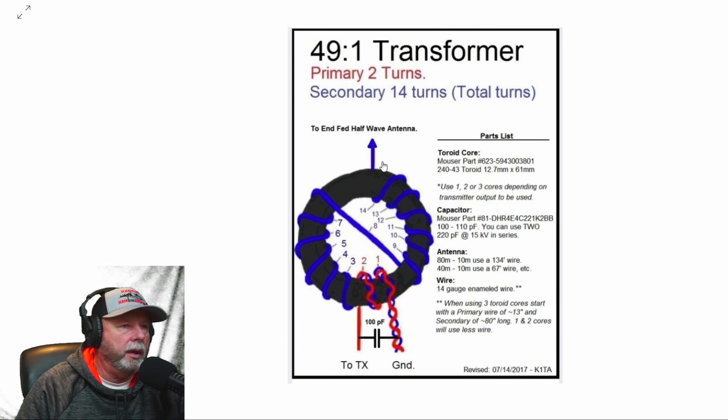The end here goes to the antenna. What I'll do on mine is put a plastic wire tie across here to hold this where it is, and then this will end up getting bent under. Somewhere in the middle I'll attach the antenna wire to itself, but also put a knot in the wire. So when it goes through the binding post connector, that knot will be your strain relief, so it won't pull through and possibly injure this connection. This wire here will go to your red binding post, and this side will go to the black side. We're going to use a crimp connector — solder it and crimp it and throw it onto those two binding holes.